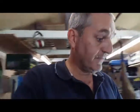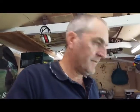Oh, we're out of the time now, give them a bit of a time. We've got to allow, say, about 15 minutes for the last one, and that's for the martensite to form, basically. I get mixed up sometimes with austenite and martensite and all the rest of it, but anyway, the blades are all wrapped up in a couple of layers of towel. I don't want the temperature dropping, and we're off up now.